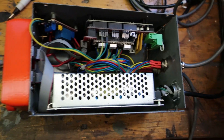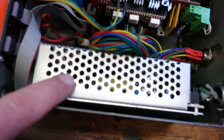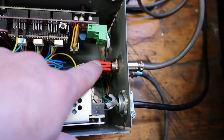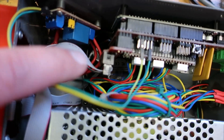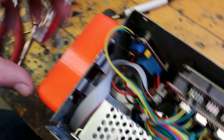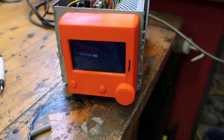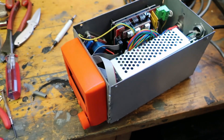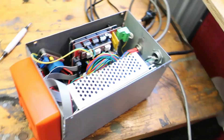We have this pretty much together — Arduino, RAMPS, relay, power supply. We have X and Z axis on the 8-pin, Y down there on the 4-pin at the bottom. The fan is way down in there. Display — that display case we made. Yeah, I know it's crooked. I think it's ready to mount on the machine and do some testing.